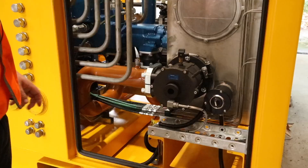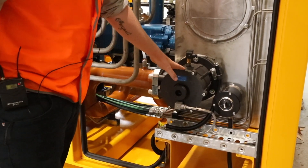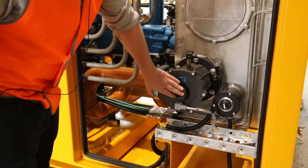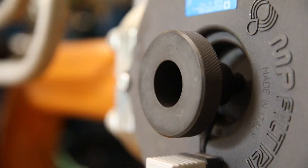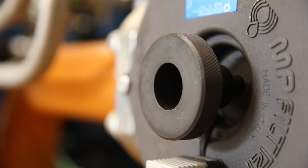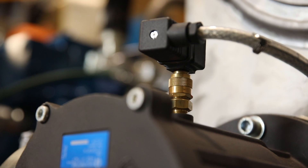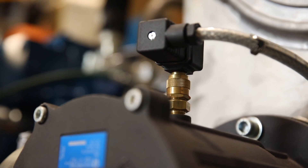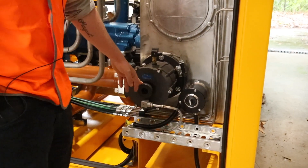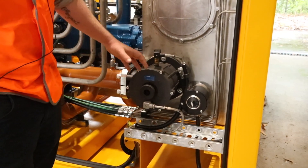This area of the hydraulic reservoir features a suction isolation and strainer which has an inbuilt closing valve mechanism, so we can close this valve and change the inbuilt strainer element without the risk of the tank volume displacing. It also has feedback on valve position to ensure that the control system knows not to start the pump when the valve is closed, because that provides a risk of critical damage to the very complex and expensive pump. If the suction valve is closed and we try to start, we'll create cavitation and damage to the pump.